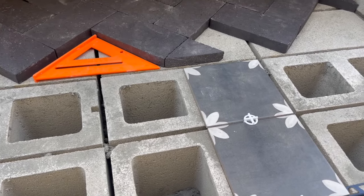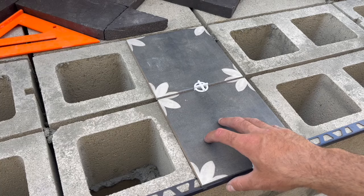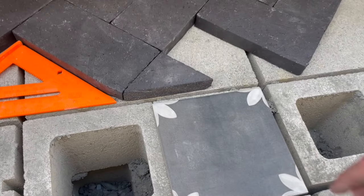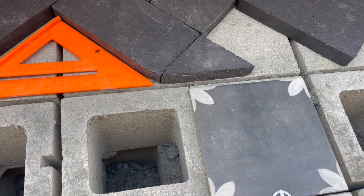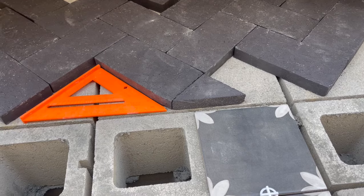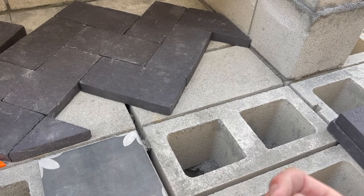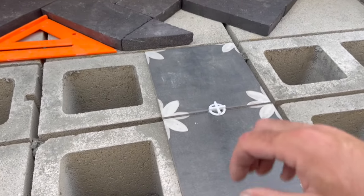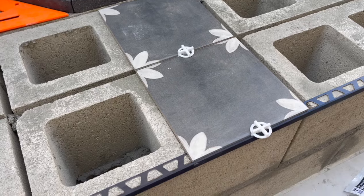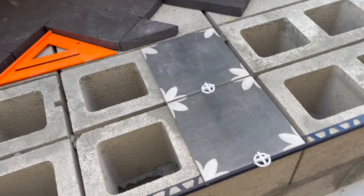This step is really all about planning. We're gonna put this tile on the hearth of the fireplace, and I just wanna make sure I'm doing the least amount of cuts possible. So if I do 2 full 8-inch tiles, that puts us right towards the back edge of this firebox. So what I'm gonna do, I think, is try to slide the brick forward just a smidge to be flush with these sidewalls, maybe proud just a little bit, and then we're gonna be able to just put two full length tiles on the front.